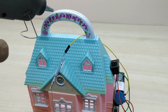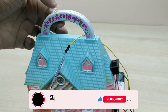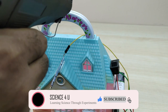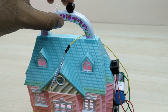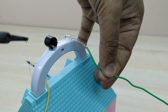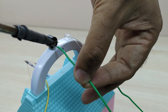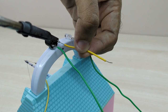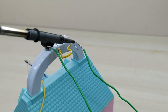I also added an alarm and light which gives an alert in case an earthquake is detected. Solder the positive terminal of the LED bulb with an electrical wire. Now solder the positive terminal of the buzzer also with an electrical wire. Then connect both the negative terminals of the LED bulb and the buzzer and solder an electrical wire.